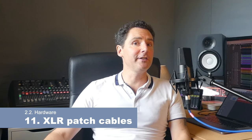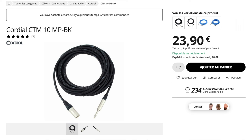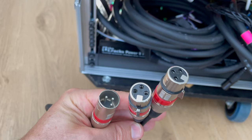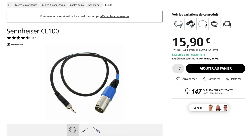You also need a lot of cables and accessories. We've purchased various cables from Thomann and Amazon. You need XLR male to XLR female patch cables — not too long. I also took 10-meter XLR male to XLR female cables, in black for inputs and blue for outputs. You need a dual XLR male to jack male cable for the keyboard. You need XLR male to jack female adapters for the bass — really cheap and convenient. You need a Y cable with two XLR female to one XLR male for stereo wired IEMs. And to connect the click, because our drummer uses his phone for a click track, I connect the phone with a USB-C male to mini jack female adapter — I recommend the Apple one, even if it's expensive, because it just works every time. Then you connect a mini jack male to XLR male so that you can plug it into the rack.